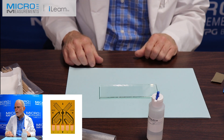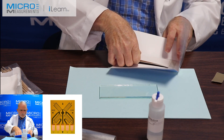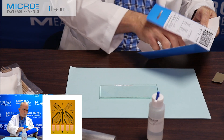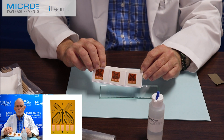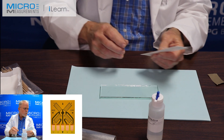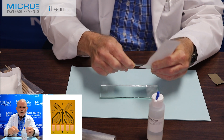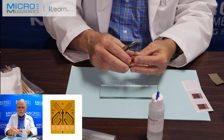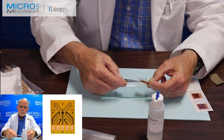Now that we've established the surface of our glass is clean, I'm going to open up my package of gauges. This is a 250 USA — it's a 350 ohm — and we're going to be bonding this as a full bridge torque or shear transducer. Notice the classic windmill shape of the 250 US. It also has a smaller cousin, the 125 US, which is half its size. The first thing we're going to do is locate our blunt nose tweezers, BTW1, and remove the acetate folder from the packaging. Always, where practical, grab the gauge near the tab end, as far away from the grid as is practical.